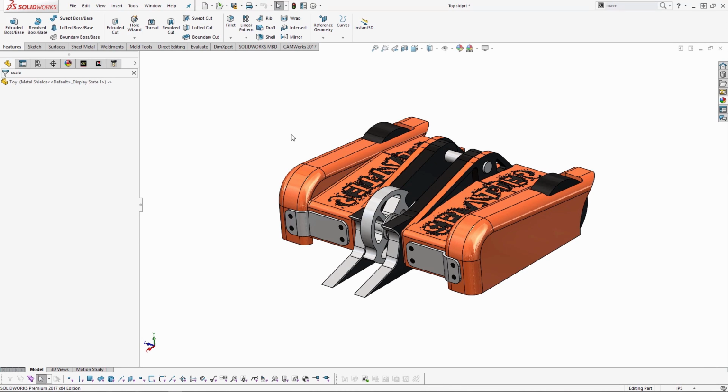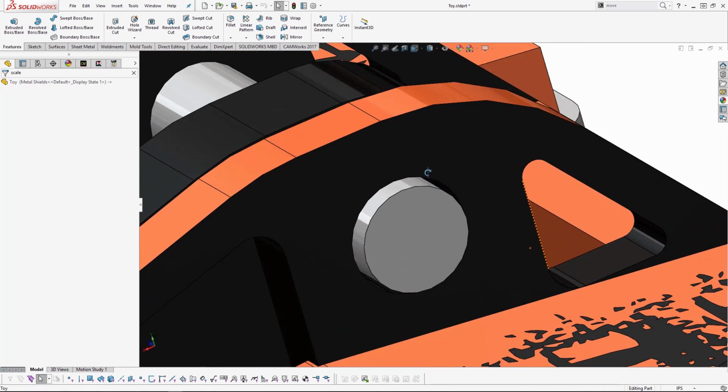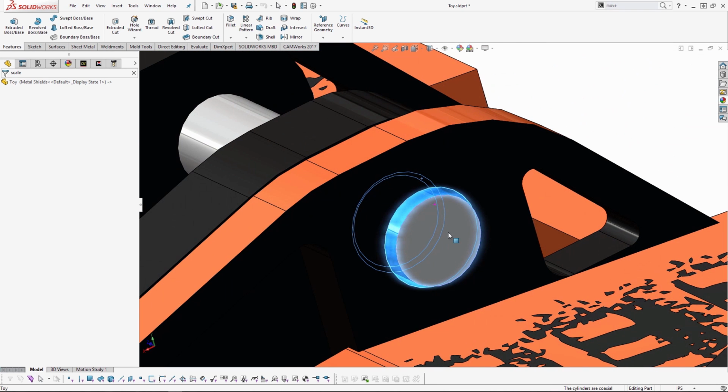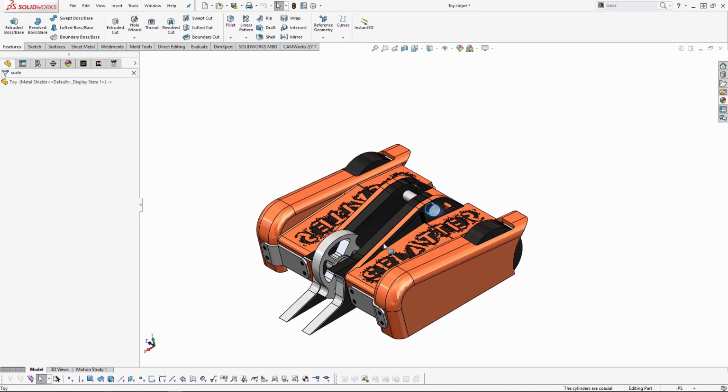Now, you don't always have to do that. You could scale first and then go through and make sure all your clearances are correct. And that might be the more straightforward way. Instead, I knew I was going to scale it later on. And so what I did, when I created clearances like between this shaft and this hole, is I did 12 times the clearance I knew I needed. Okay, so in this case, I used 7 or 8 thousandths clearance between all the moving parts.